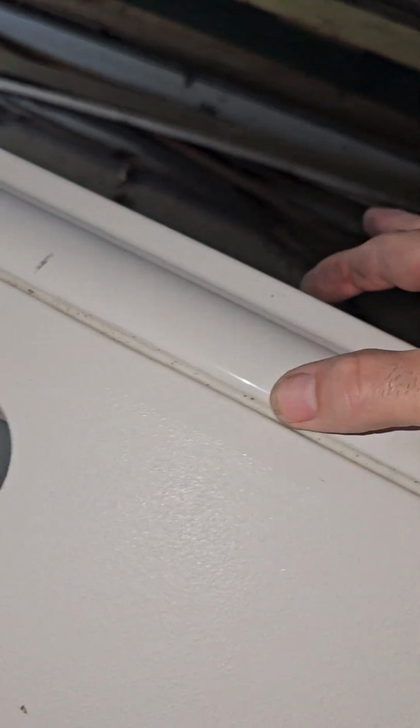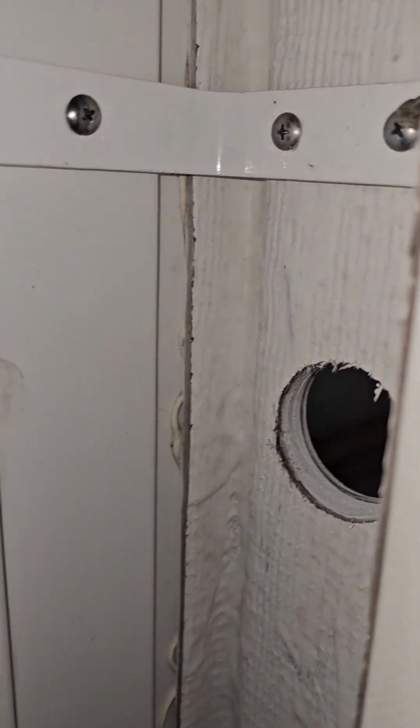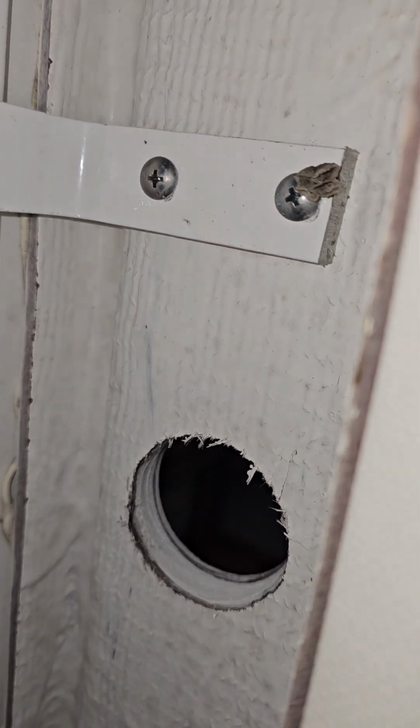On the boat, this is the boat, then a lot of them have these caps. And these caps sit in there, and they're not really reinforced by much. You see how they put 5200 on it, and they put these little brackets to hold the cap, and a couple screws around the edge. I mean, it seems pretty strong, but if you get a big fish like I do and use electric reels, I want something that I ain't gotta worry about. I don't want to lose my reel. So anyway, it also gives you something to screw to.